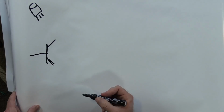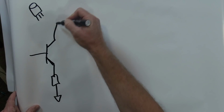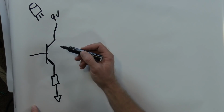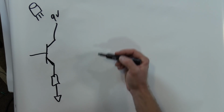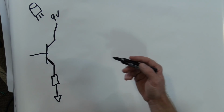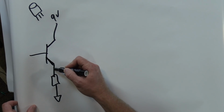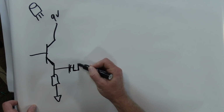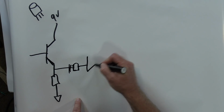That's my transistor. We have this transistor that goes to 9 volts. The sound comes in right there. Now, if we wanted to use this transistor to boost volume, we'd add some resistance here and come out this leg, and life will be harmonious and awesome and it will be louder. But we're using it as a buffer. So we're going to come out this bottom leg right above this resistor, put some capacitance in there and a little resistor, and go into an op amp stage.